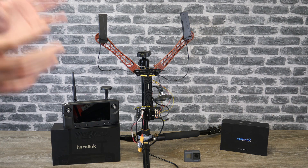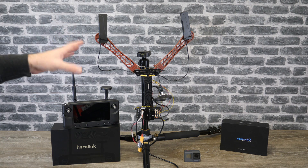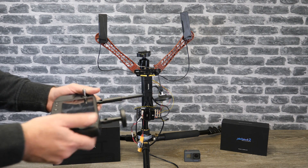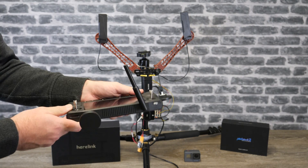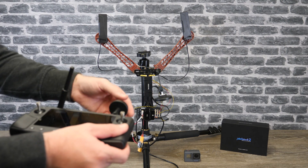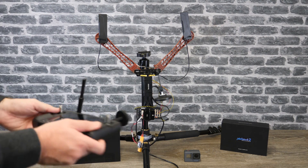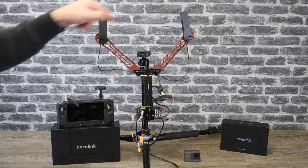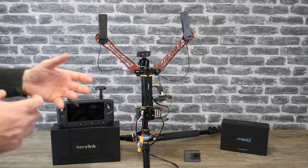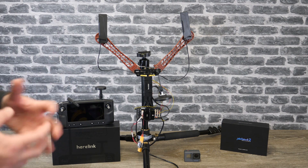That's pretty much it, but a few things I want to touch on before I end. This system was entirely in factory default settings when I did these range tests — I changed absolutely nothing. The antennas: the left antenna should always be in the vertical position and the right-hand antenna should be pointing at the antennas on your air system — not pointing up, but pointing at the system you're using. With regard to the air-side antennas, you want them basically vertical. You can have a slight angle on them, but the guys over at ProfiCNC said to go virtually vertical with the antennas for your best possible range.